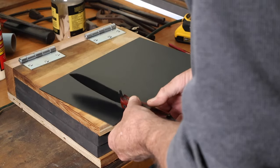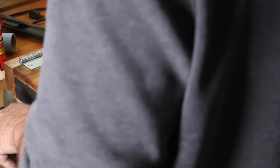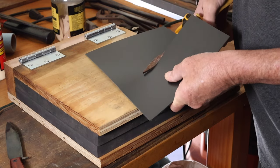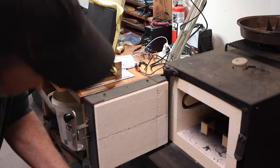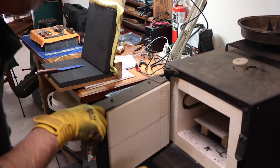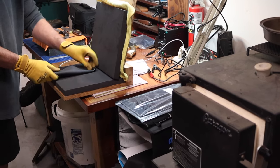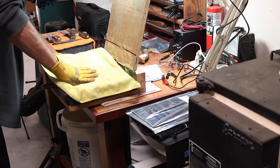I'm using 61-thousandths (.06 inch) thick Kydex. I'm going to make a taco-style sheath where it just folds over on the spine, so I'm cutting one piece out. I measured out my knife, laid out a line, and just cut my piece of Kydex out with clippers. I put that in the oven at 375°F, let it warm up for about five minutes. I taped up the knife blade with one layer of painter's tape, wrapped the Kydex around it, put it in the press, clamped it down, and let it sit and cool off for maybe five or ten minutes.